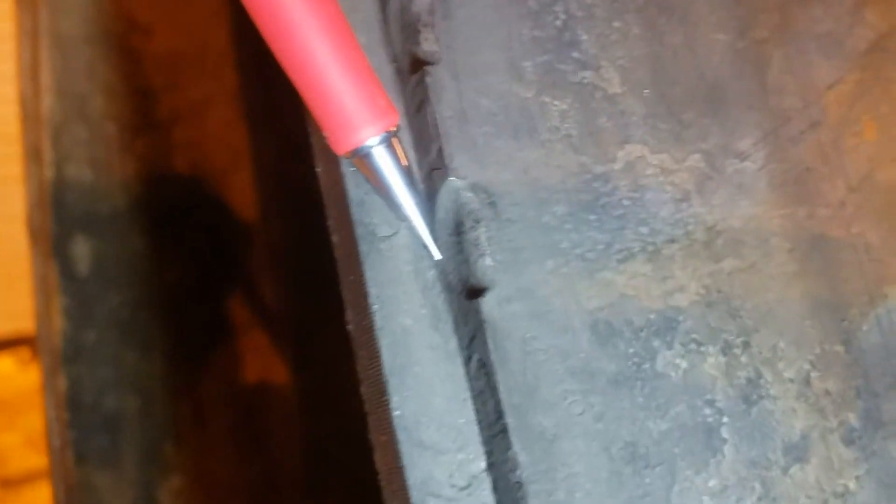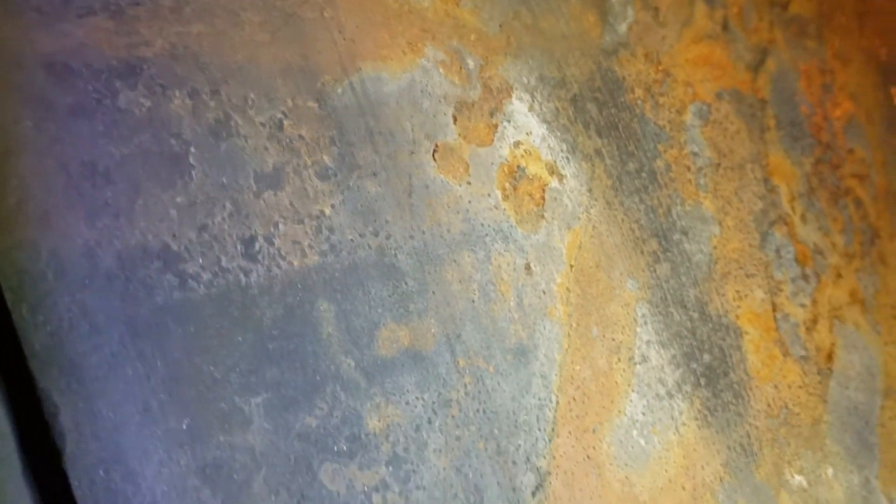If you look carefully, you can see not only at the edges, but a path downstream into the body of the pass partition plate. Notice how it's going over the edge and going onto the body. That streaking you see is actual paths from each individual tube. It's pretty spectacular. It's not every day we get to see this kind of erosion right there at the step of the pass partition plate edge.